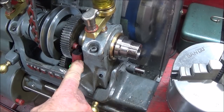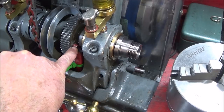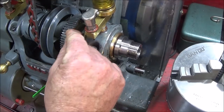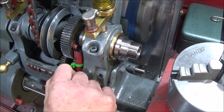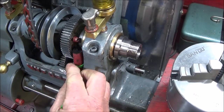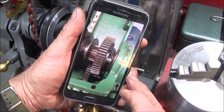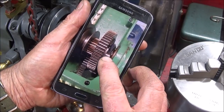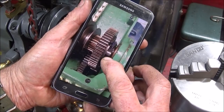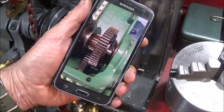I'm pretty sure it would actually work on the Super Seven as well. I've looked at my brother's and there's a lever mechanism there which is really the same thing — it's just a lever rather than the allen bolt. I reckon as long as that one's tightened up like this one, you could put one of these in there and remove a stuck chuck. There's a photo of my brother's Super Seven lathe with the lever mechanism, and I reckon if you put the PVC on the diameter of that lever, as long as it's in its locked position, it will work exactly the same.